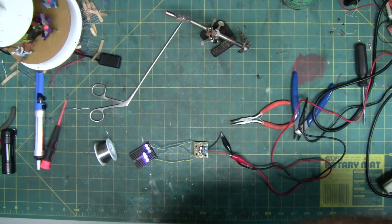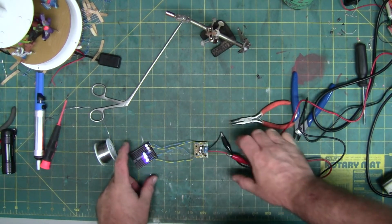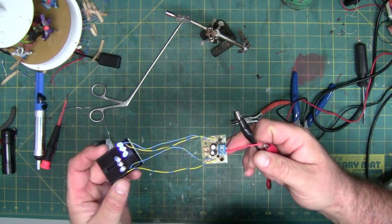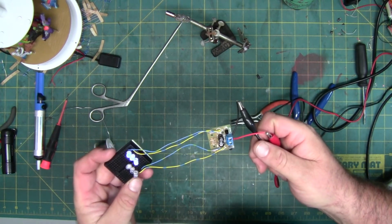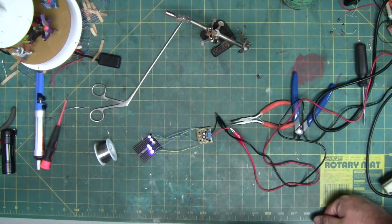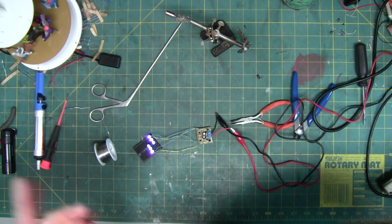So, next is to continue, get this in, and then put the rotating mass back inside and then work on that gear. But I wanted to show you, this is called a flip-flop circuit. You can buy them on eBay. It's like $10 for 10 of them. I couldn't find them individually, which is fine. I've used it before in one other piece actually. By changing the resistor or a capacitor, you can increase or decrease the speed and the brightness of the lights. So, next time when I show this, it should be assembled with working lights, and then I'll be working on the gears and trying to make the rotation function like it's supposed to.